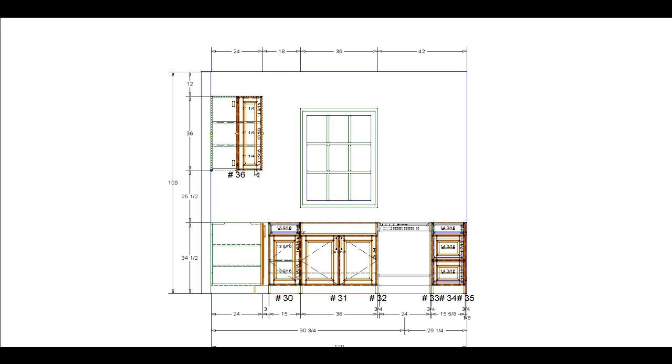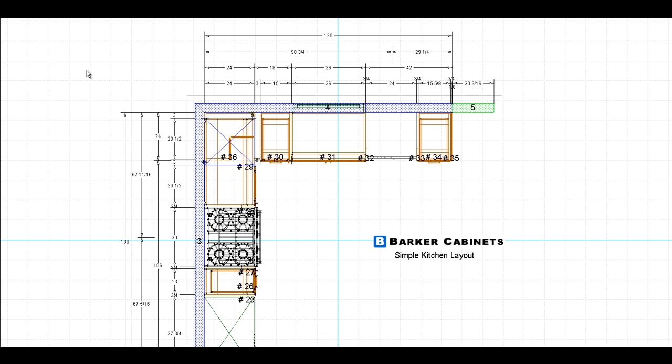And I like to make the bottom of my cabinets a certain dimension. So you're going to need to figure out what dimension you want the height of your cabinets to be. In this case, when I have 108 inches, I like the bottom of my cabinets off the floor by 54 inches. That's what we've always used for industry standards. We see that a lot. It looks the nicest, it doesn't look out of place, and it just looks correct. So, the actual bottom of the cabinet to the floor, not including the under cabinet light valance or anything like that, is at 54 inches. That makes all my cabinets 42 inches tall with that 12-inch air soffit up above. The biggest thing here is just 54 from bottom of the cabinet to the floor. That's it. All right, so let's move on.